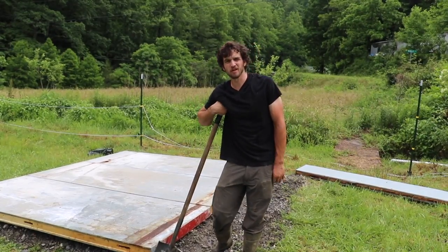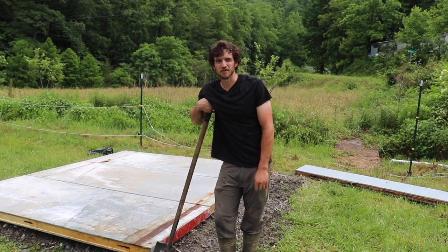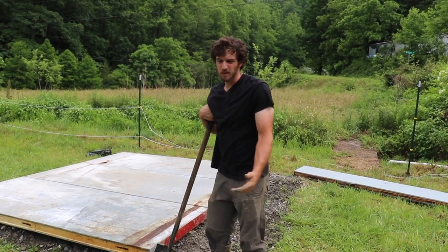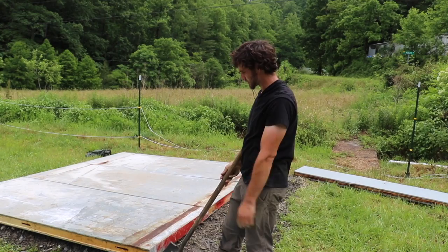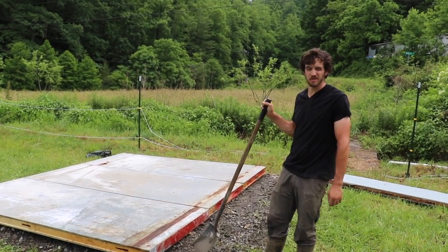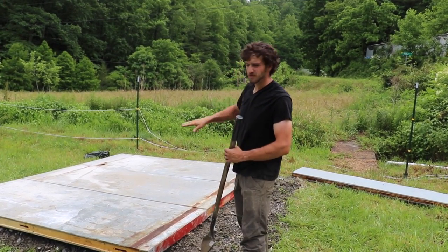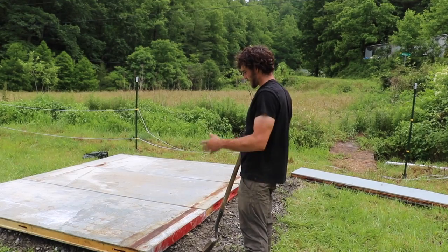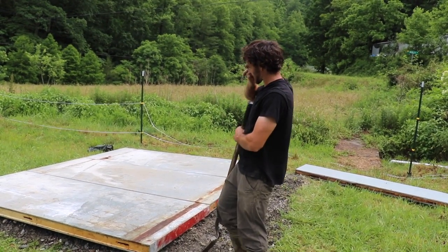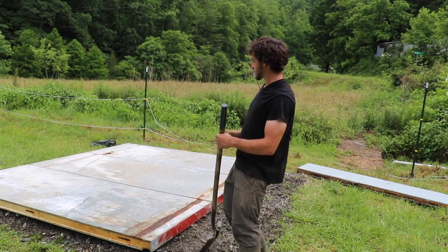So today we're putting up our walk-in cooler. A few things about this project — we don't quite know if it's going to work. It's a little unorthodox. Since we don't own this property, we didn't want to pour cement, so we put down some road bond — it's called ABC Stone, it's cheap, about $6.50 a half ton. It kind of goes on a slope, so we tried to level it out the best we could. It's still going to be on a slight angle, but that's fine because you actually want a little bit of an angle so any moisture will run out of the cooler.